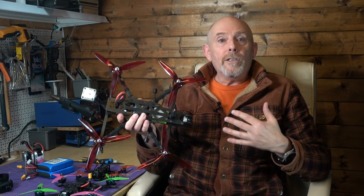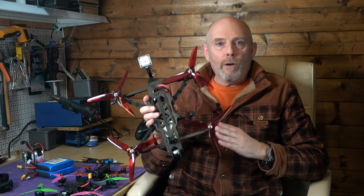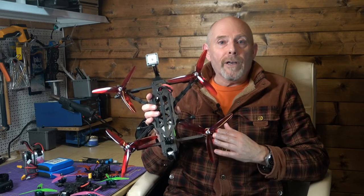I'll show you how I built this, the components I selected, some flight footage, and the final setup and tune that I settled on. I chose iNav 4.0 for this rather than Betaflight. iNav has always been a great fit for 7-inch quads, and version 4.0 is just fantastic — you get nice smooth acro performance plus the big advantage of position hold and return to home when you want to fly long range or long duration. It gives you fantastic peace of mind.